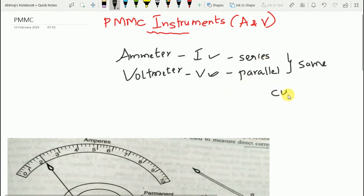Both ammeter and voltmeter are current-operated devices — the deflecting torque is produced when current flows through their operating coils. In an ammeter, the deflecting torque is produced when the full current or a fraction of the current we wish to measure passes through the operating coil. In a voltmeter, the deflecting torque is produced by a current proportional to the potential difference we wish to measure. The same instrument can thus be used as an ammeter or voltmeter with proper design.